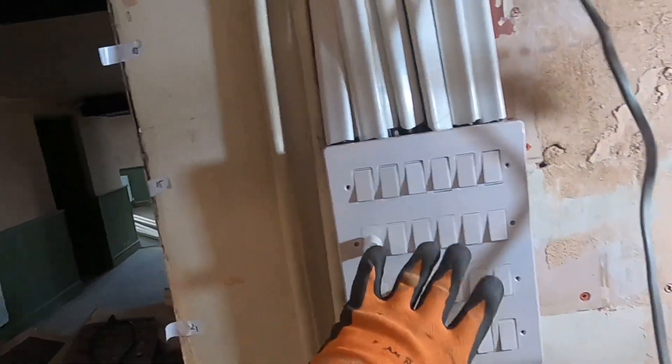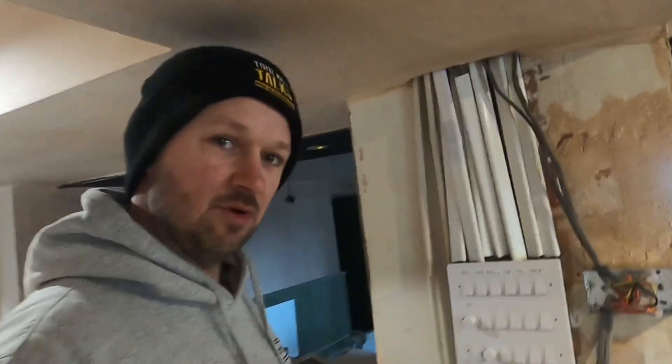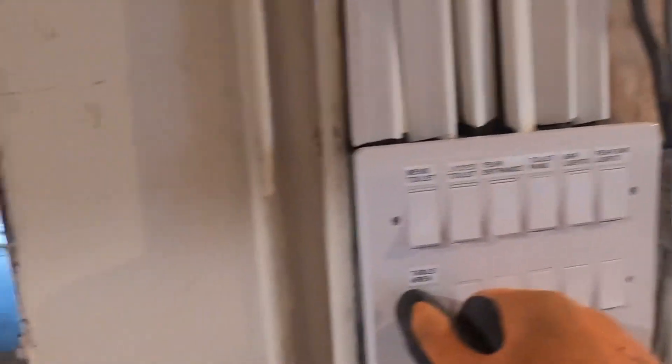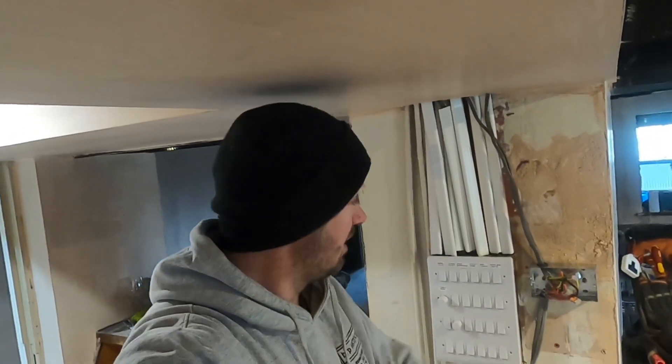I can put nice neat labels all along the bottom. So there we have it — I've put some little labels on to show which is which. I want to confirm when I've tested them all that the wall lights come on in different areas — we've got the table area, bar lights, rear bar lights. There's a bit of ongoing work to do, but it's changed, all the cables are in, so the plasterer can plaster and board that out. Make sure to like this video and subscribe to the channel for more videos on electrical work as an electrician in the UK.